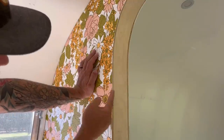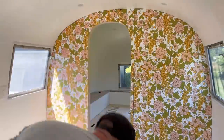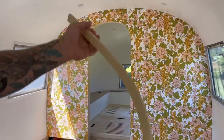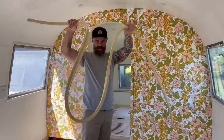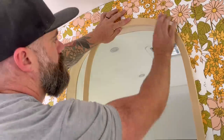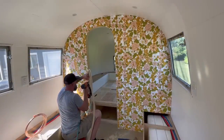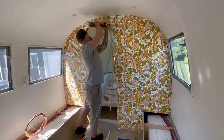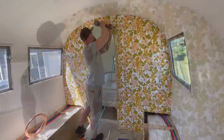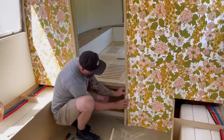There was one issue on the interior of the archway where you could see two pieces of exposed plywood — enter this floppy noodle, aka flexi trim. Apparently flexible trim is a thing — I found this stuff on Amazon. It's just what it's advertised as: flexible trim. I don't know if it's a hard rubber or acrylic, but apparently you can tack it up just like regular trim and it's paintable. The instructions say to glue and tack it in place, however I opted out of gluing it because I didn't want to make it that permanent should I ever need to take it down.